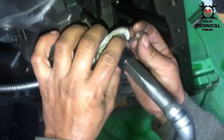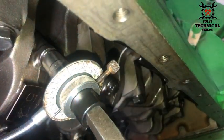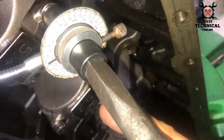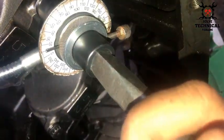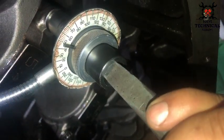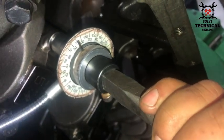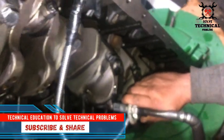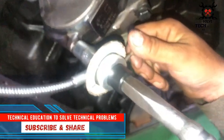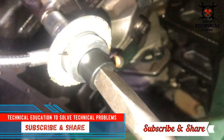Now we are giving the degree wheel torque on the connecting rod bolts, which is plus 90 degrees — we are giving it almost 100 degrees. But first, in step one, you have to give it 43 foot-pound or 58 Newton meter torque with the help of a torque wrench. This is a John Deere 6068 engine, and the manufacturer has recommended a degree torque of 90 degrees or above.